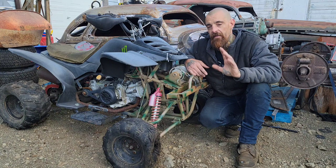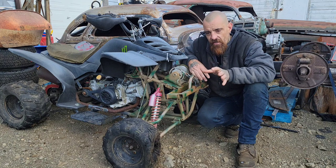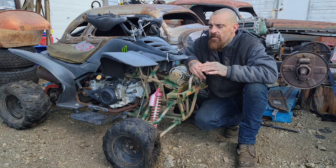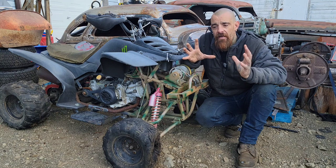Now, starting at the motor, you need a clutch to transmit the power. You need a centrifugal clutch so that it's just not taking off. You can get those on Amazon starting for, say, $30. And pardon me, this is in Canadian dollars. Americans and people outside of the country, you can do the conversion. That's kind of your most basic centrifugal clutch. It just has a weight that as it spins faster, the weight goes out, applies friction, and it pushes you forward.